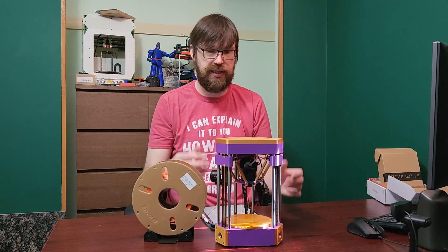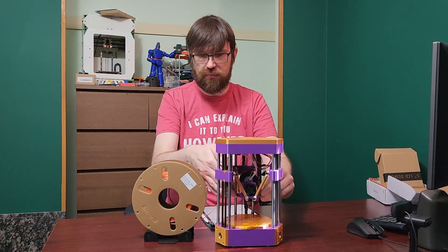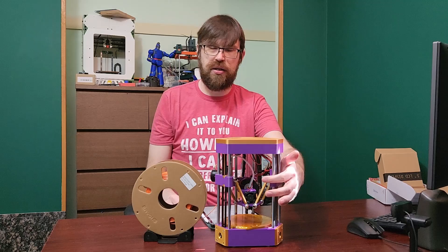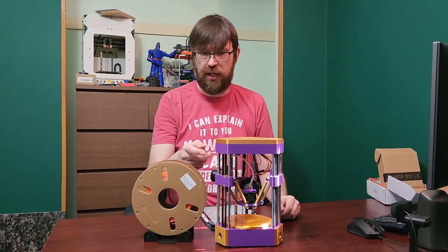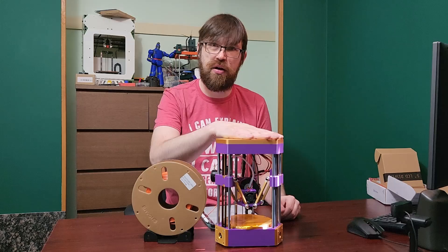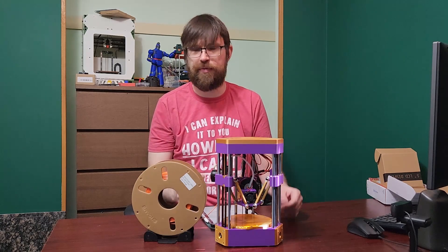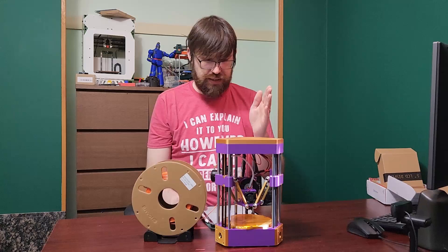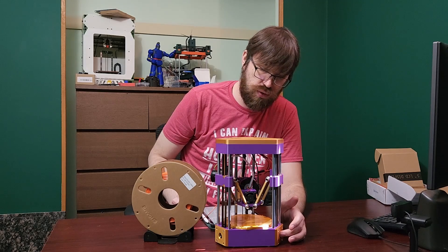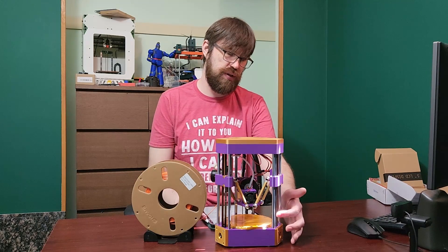This follows in line with the Rook — it's mostly 3D printed: printed frame, top and bottom, and even the arms are printed. I'm using some metal ball joints from AliExpress, very inexpensive, and iGUS bearings to keep it nice and quiet. This is the early prototype; I've already put a lot of fixes on printables, including clamps for the bearings and a better effector. It does have double shear motor support on the bottom with F695 bearings — three of them — fully supporting the motor shaft so you can really tighten these belts down nice and tight.